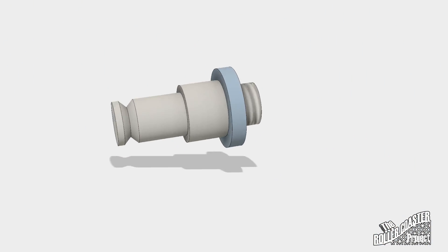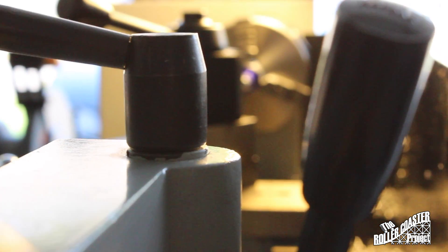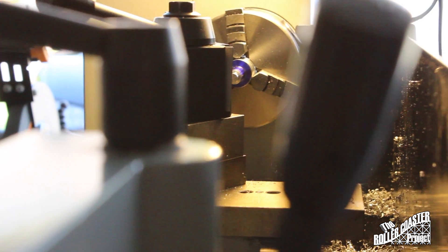The problem we had with our axles before was that they were actually done on the mill rather than the lathe. However, we want rotational geometry to be fulfilled and we want it to be concentric, so everything has to be rolling in alignment — so we decided to use the lathe.